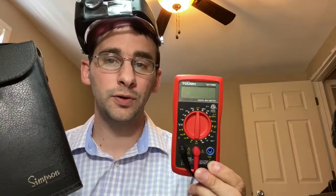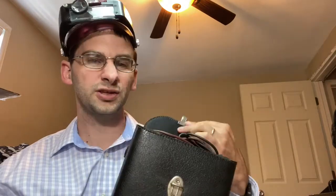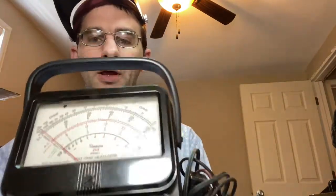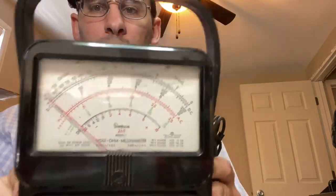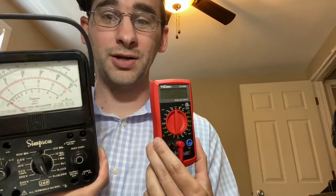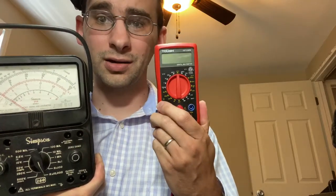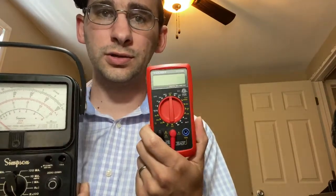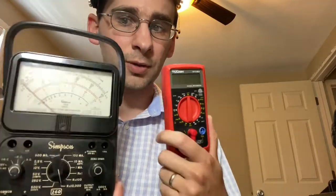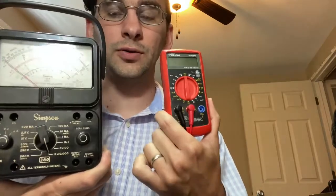Now this is a digital multimeter, and this Simpson here is an analog one — it's older. A lot of people don't know what to do with it when they see it. It uses a needle graph basically. There are benefits to using this over the digital. You can use this to check MOSFETs — you can't use the digital to properly look at it and say 'yeah, okay, that looks good.' If you know what a good MOSFET looks like in a circuit, this bar graph will show you. On the digital screen it just shows you resistance, and that's not always good enough. There are benefits to using both, and typically a good technician will have both meters on their desk.